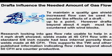But welders say they need more flow because of drafts. Testing a controlled amount of draft showed 65 CFH caused more internal porosity than 45 CFH, validating the Welding Institute's report. If a draft is over 4 to 5 miles an hour, use a windbreak.